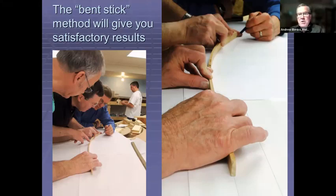but having to transfer it to plywood. So no matter what you do on paper, you still have to somehow get that over to plywood, and that's what we did with laying out the paper and piercing it to make some marks in the plywood, then come back and basically redrawing it.